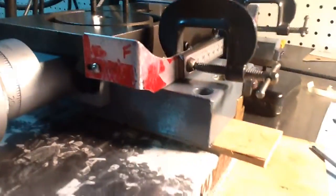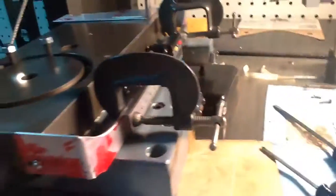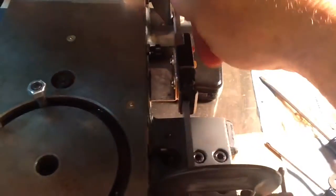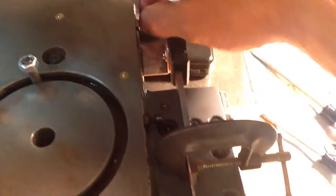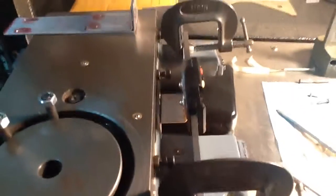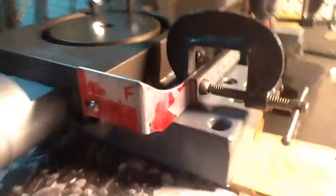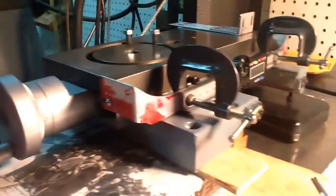my semi-finished brackets for the outside, and as you can see, they stand off about an inch, and the purpose for that was I wanted to give plenty of room for adjustability for the gib screws, so I could tighten that up, tighten the cross slide off back and forth if I need to. And so I've got it bolted into position. It's fitting pretty good now.